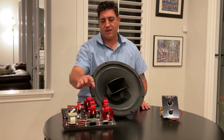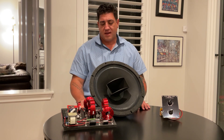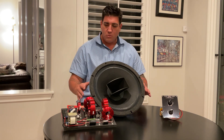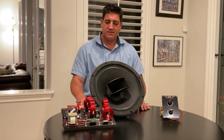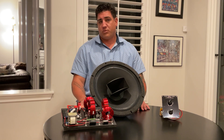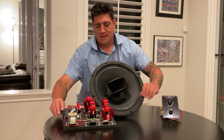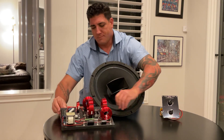So what this is, is new thinking. My very good friend Al Klappenberger of ALK Engineering was kind enough to design for me a brand new crossover for an Altec 604. There are some newer style crossovers for the Altec, but this is original thinking specific to Al's design. It's a Linkwitz-Riley network — fourth order for both the low pass and the high frequency. The high frequency is adjustable with an autoformer. It's pretty special, truth be told, and we're going to put it to the test.